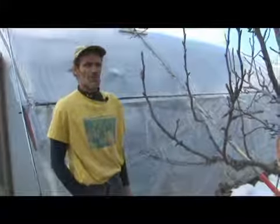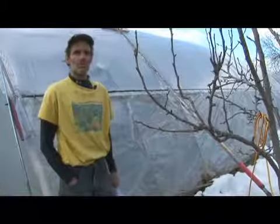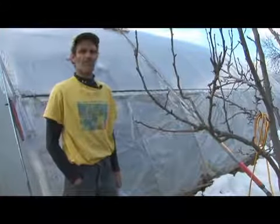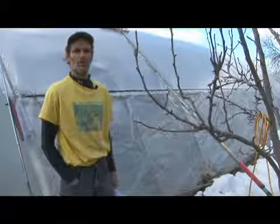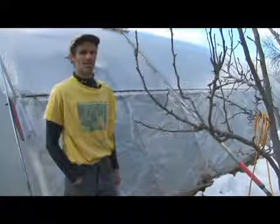There are several considerations to manage the snow load. One you saw on the inside of the hoop house — my locust posts that were wedged into place under the center purlin, giving the spine a lot of support from below. That's a bit of insurance, but it's not adequate for some of the heaviest snow loads.